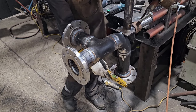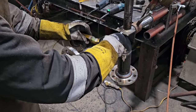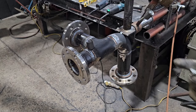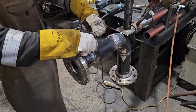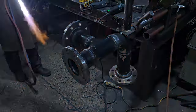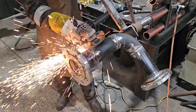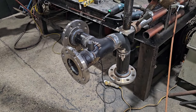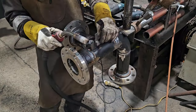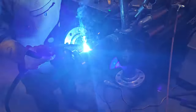The welding mask I'm using is a Speedglas G501 - it's an air-fed respirator that keeps my lungs nice and healthy. The thing on my hip is the respirator that pumps filtered air into my mask. I'm also using an extractor fan because UK and European law requires respirators for welders and local extractors for the rest of the workers in the workplace.